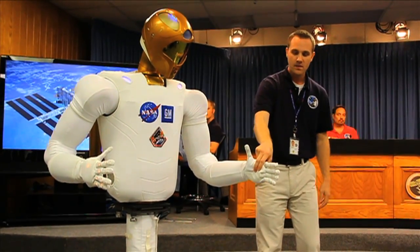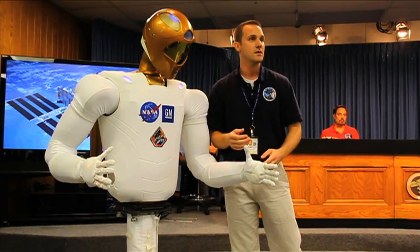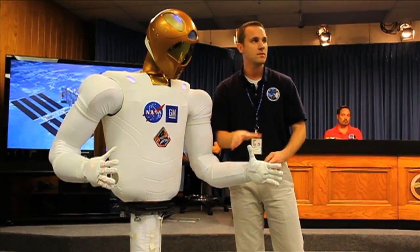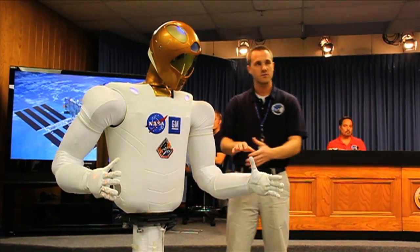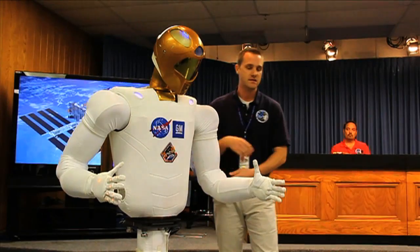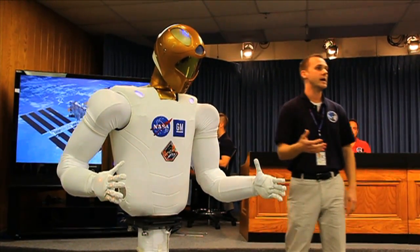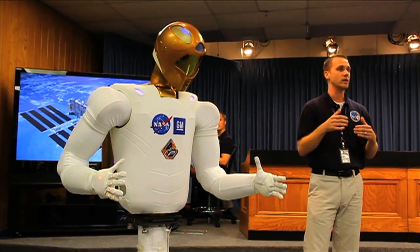The palm has a — and you can see it kind of rebounding — like a spring motion. It has a certain stiffness to it, but I can vary that stiffness in 3D space. I can also vary what part of the robot manipulator I choose to make how stiff. For example, the elbow isn't nearly as stiff as the palm is. And so when I am doing assembly activities or construction activities, this is a very key feature to doing work really well.